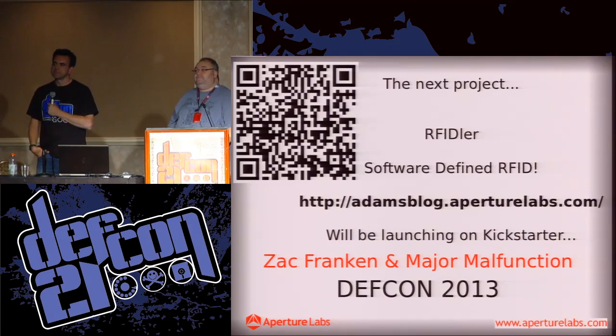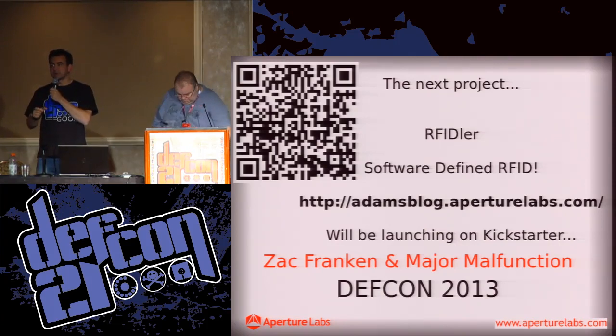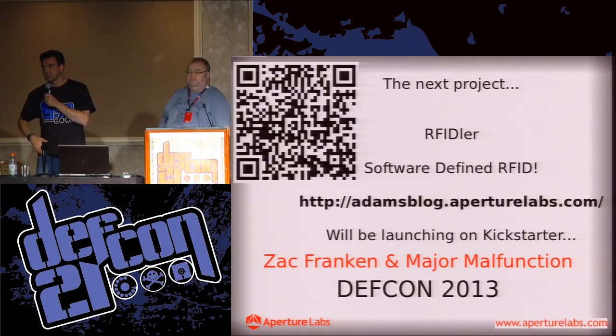So can you generate the CRC after the fact to make sure it's still good? Yes, in fact, the disassembler, my disassembler, will show you what was stored. The last 2 bytes in the ROM are the checksum, and it will also recalculate and tell you what those came out as, so you can see if they match.